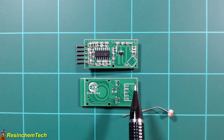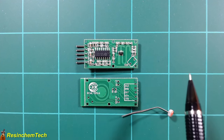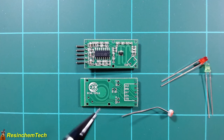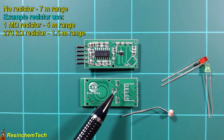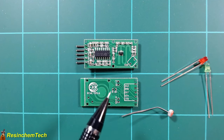There's also a 3.3V output pin — this is 3.3 volts out, not in. At 100 milliamps, you could easily power something like a temperature sensor or an LED from this pin. The R-GN pad — resistor in the gain — lets you apply a resistor to lower or shorten the range detection. This gives the RCWL-0516 some extra flexibility over a PIR sensor.